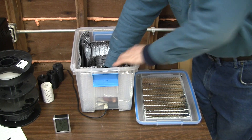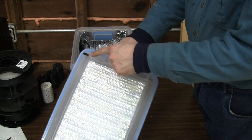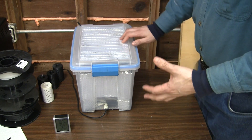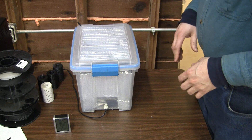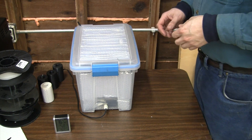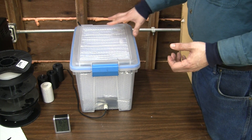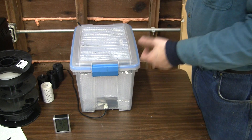Either way it gives me a good reading of what's inside. While this is a sealed container, I also have a couple of holes in the back corners, and then two holes here. You don't really want a completely sealed system when you're trying to dry, because after some point the air inside will be saturated. Having a small number of holes to help bring in fresh air and expel the saturated air is beneficial. Less holes will allow you to have more heat in there, but after some point it's just going to be saturated air and a few more holes might help you more.